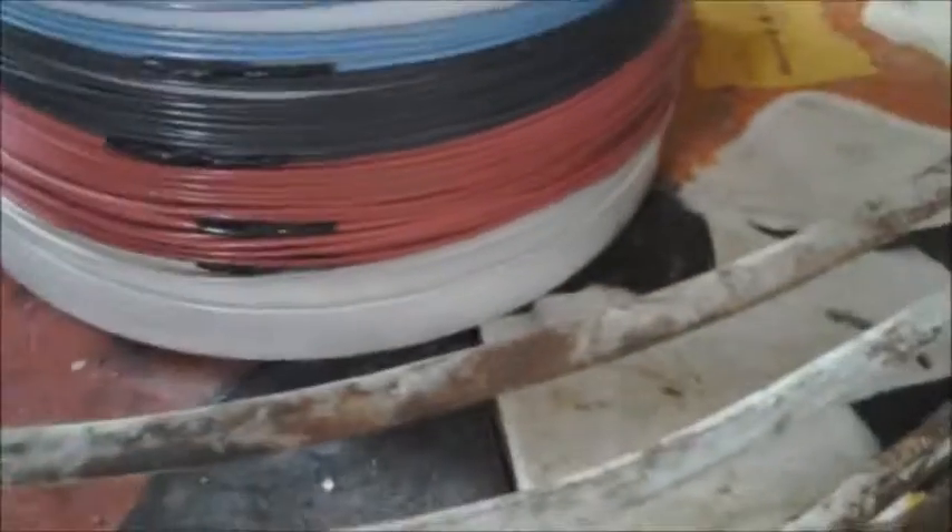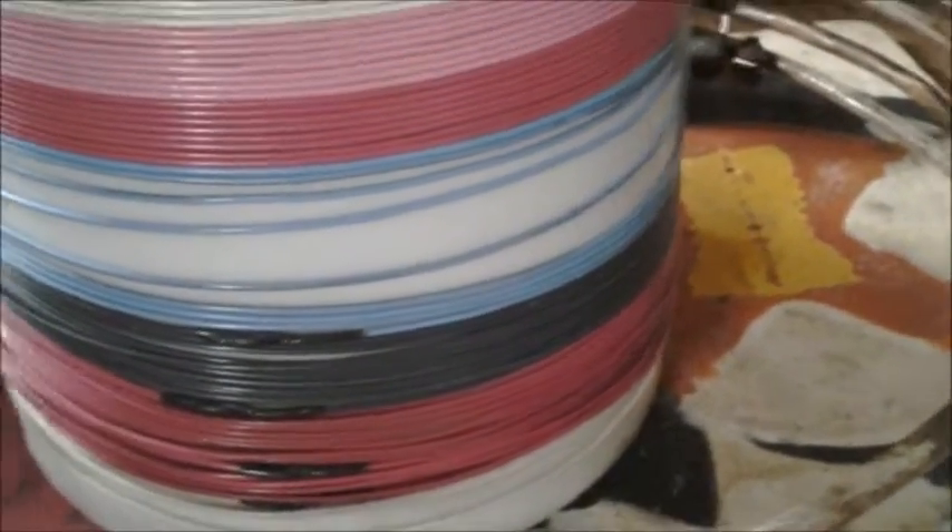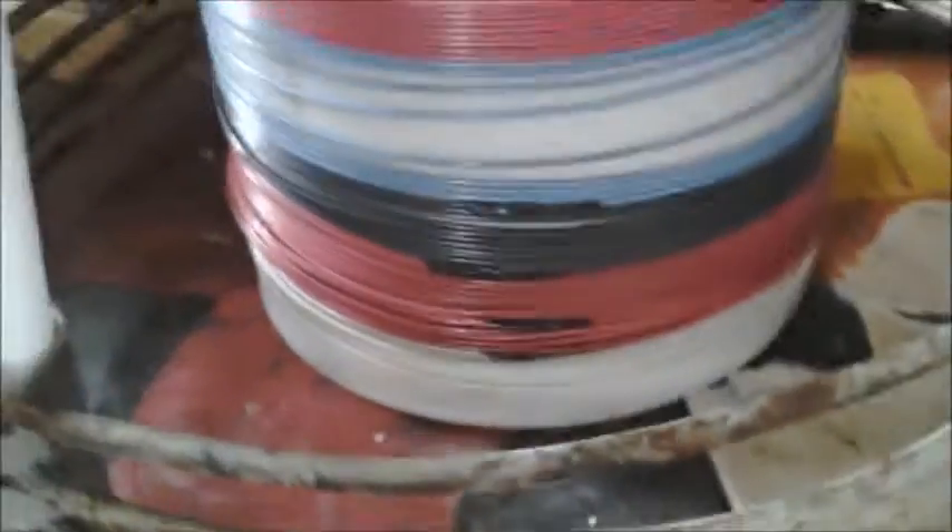The primary with all those capacitors and this top load is balanced out at almost one turn — not even one turn. I've had this thing all the way around five turns depending on the capacitance. I can maintain resonance on this piece-of-crap coil with splices — it's number 12 THHN, folks. And look at the secondary: it's falling apart, and it still works fine.